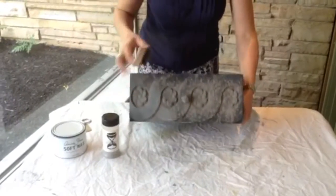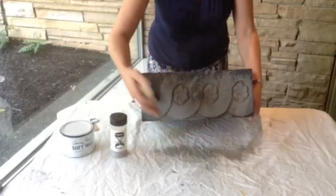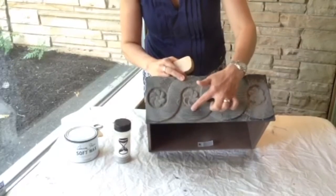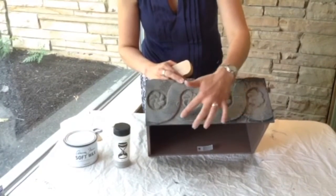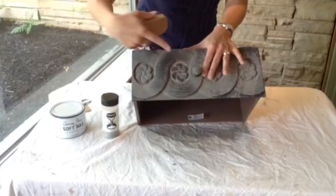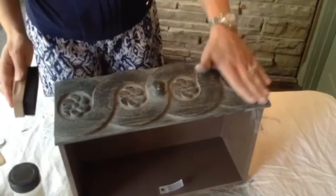If you've got a lot of excess on here, you can tamp off the extra before you start and feel free to put it on a little piece of paper and dump it back into your aging dust bottle. You can see as I'm buffing it, I'm getting a nice sheen in here and that aging dust is settling down into all of that detail and the roughness in the wood. By buffing in different directions, you can get the aging dust to really play up the detail on the edges. It's going to leave a really nice charcoal-y gray type of patina on it — really smooth now too.